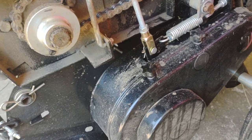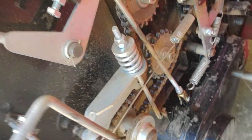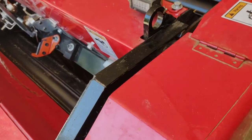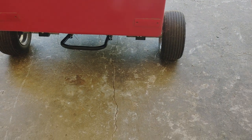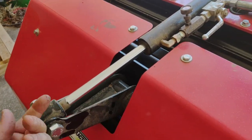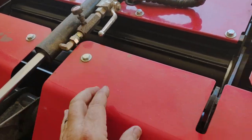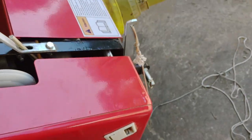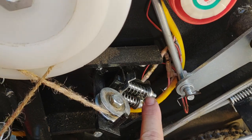If you let your hay get too dry, it really packs up in here. That's what happened to us — we had a little tractor issue and our hay got too dry, and it caused it to really bind up. You can see that little kicker bar underneath right here. That little kicker bar makes sure that when the door opens, the hay will roll on out. There's a hydraulic cylinder here that retracts and opens the door. You can shut it off to hold the door open and adjust the speed at which it opens and closes.